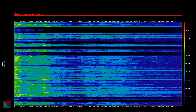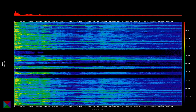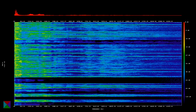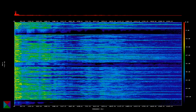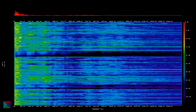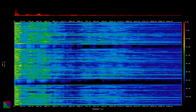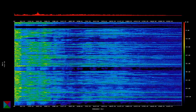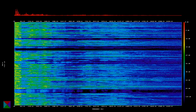This came about when I started exploring how to measure the power output of my WSPR — weak signal propagation reporter — beacon. According to the specifications, the output level is 23 dBm or 200 milliwatts. If you read the fine print, you'll discover that the power output actually varies a little depending on which band you're on. For my specific transmitter, it says that the output on the 10 meter band is 22 dBm or 158 milliwatts.